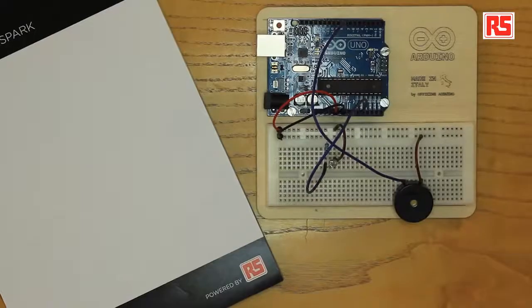The software that we are going to be using with this project starts off with a 5-second calibration period. So during this time, you will move your hand near the sensor like this to let the Arduino calibrate the values that represent the minimum and the maximum amount of light that can hit the sensor. After those 5 seconds, Arduino will start the main loop.